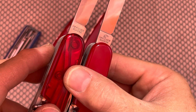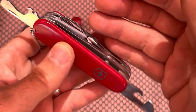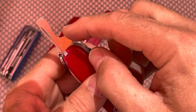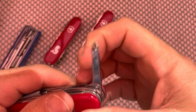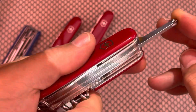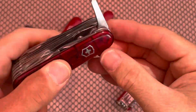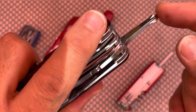So yeah, coming back to this build specifically, it has the blade layer, it has a full opener layer. So rather than a combo where you sometimes see the small blade being replaced by a combination bottle opener with a small sort of flat on it, I prefer the beefier dedicated cap lifter with the flat as an opener layer. And of course, it has the inline Phillips. What I've done is I've actually put the inline Phillips central across the 5 layers. So that makes it really convenient when you're using this as a driver to get some weight behind it and also have it central in your hand. If you compare that to, say, the Swiss Champ, the Phillips is offset quite far to the side, which means it's not as convenient to use.